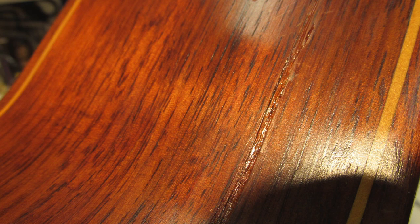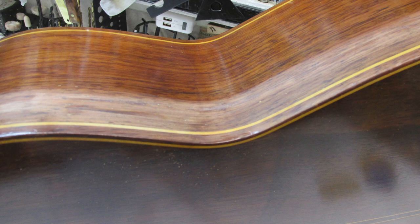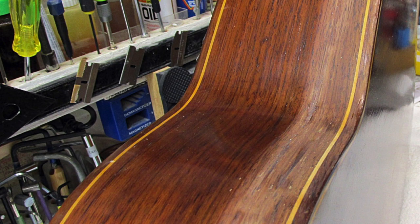There's a little area right there I can touch up, but by the end of this I had a nice bead that ran all the way the length of the crack. I wanted to make sure I could level this all out. I did not want to use any cleats, so you can see I started sanding here and leveled the finish and the Fill the Finish bead as well.